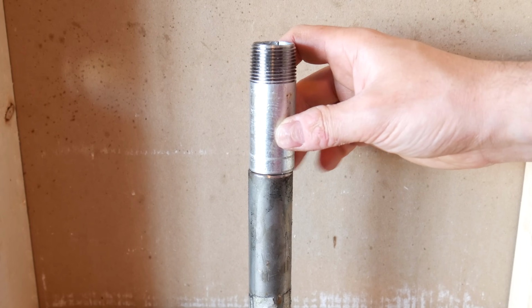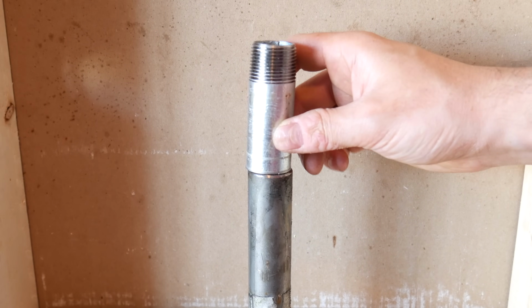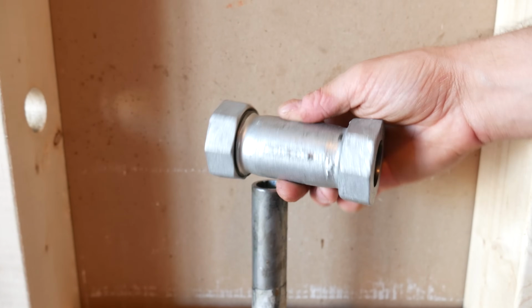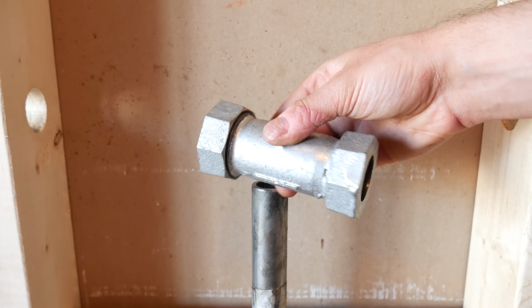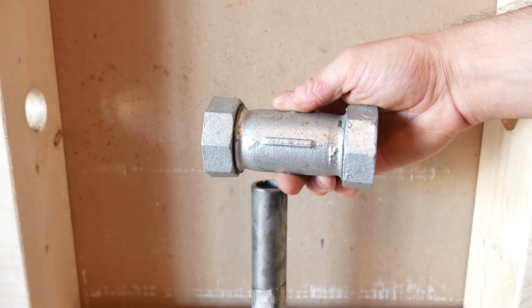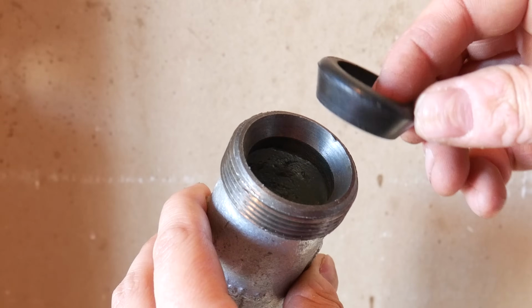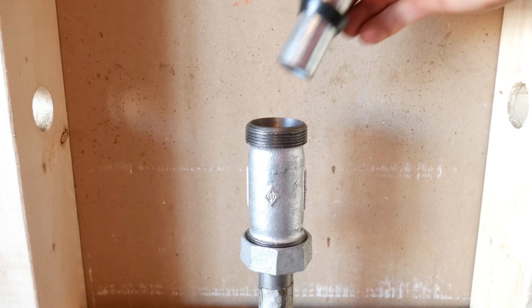The best way would be to get a welder to weld an adapter on, but that's expensive. So there's a fitting called a dresser coupling that you could buy that's basically a compression fitting but for steel and uses gaskets instead of a compression ferrule. It's pretty simple to use.